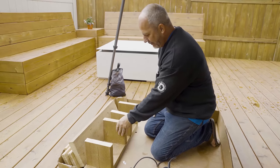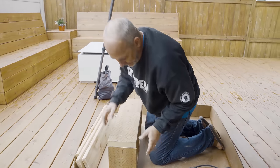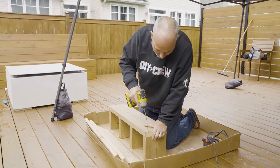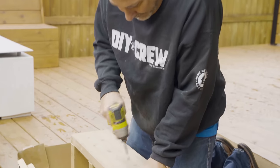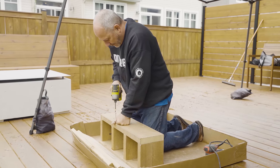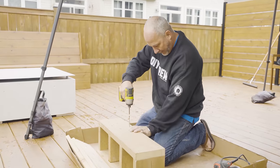The step is actually 32 inches. I probably could have got away with just one support in the middle, but I kind of like doing a little bit of overkill on stairs. Line up with the outside — lots of support for inside. The most important part here is the surface. Use the deck board to make sure everything's nice and flush. Generally when you're framing things, you want one nail or screw for every two pieces of material, but this is a stair box — I'm not as concerned with the structural load because it's going from the step right onto my pavers, and everything here is going to be just fine due to gravity.